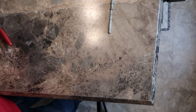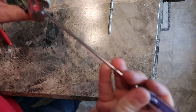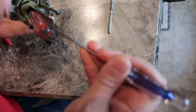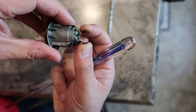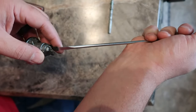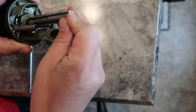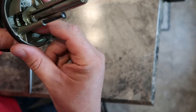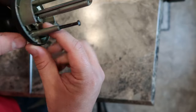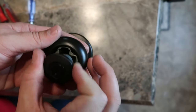Then we're going to do the same thing on the front side here. This gets a little tricky because you already have a screwdriver in there — this is why you want your longest and skinniest ones. And I feel it — and it just popped out. So what we're doing is pushing these two tabs in here, shoving our screwdriver there and there. Now I'm going to slide this back in. It's all spring-loaded so it should just click into place. Make sure that little tag there is flush with the surface.